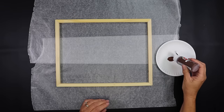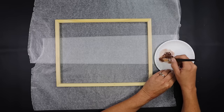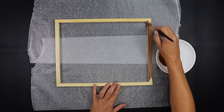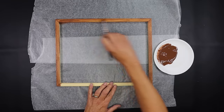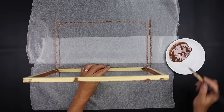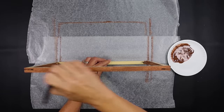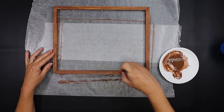We're going to work on the frame. I'm taking a brown acrylic paint called brown oxide and adding a little bit of water to thin it out to create my own stain, then applying this to the entire frame. Mine had some grooves where the frame was put together — if yours has that, make sure you dab your stain down in there so it blends in better. Once the entire frame is stained, set it aside and let it dry.